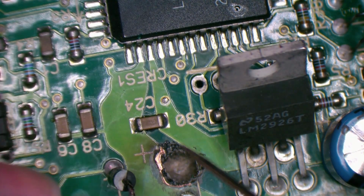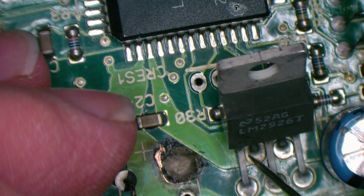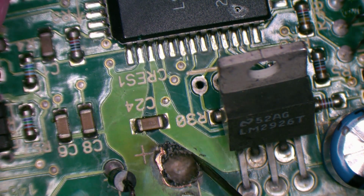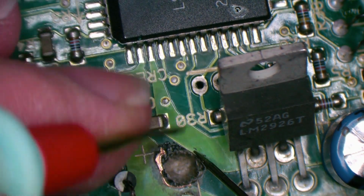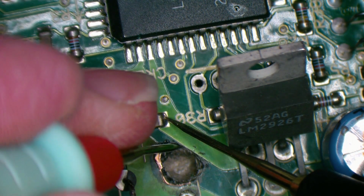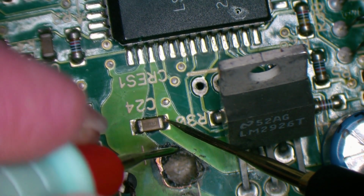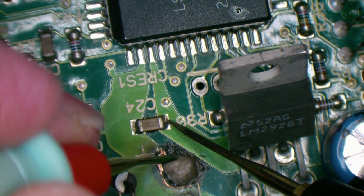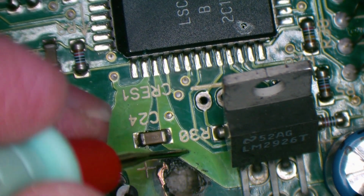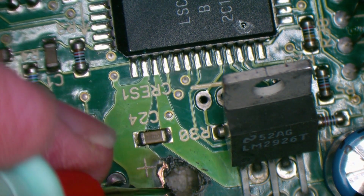So I'll just take a resistance measurement from, say, here to here, and it's going to say 3.6 k ohms. Now it'd be hard to know if that was linked to carbon in any way, but I suppose if we checked it closer to it, and it was, it would be lower. No, okay, it is. Actually, sorry. Probing on this carbonated area, I'm getting about 10 to 20 megohms through to this trace. So we do need to chew that out some more to make sure that that is not conducting through there.